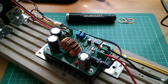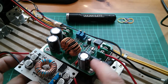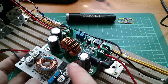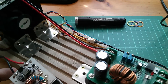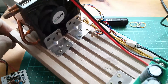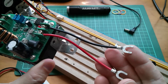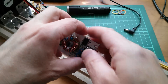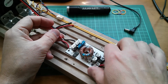So let's give this a try on my LED project board. It's going to replace the 600 watt boost converter which I normally use — a two-pot version, very similar in function. It doesn't look like it's got quite the same amount of capacitors, and I'm going to try and drive a single 100 watt LED, which is on the front of that heat sink. So let's take the 600 watt boost converter out. I'll reuse these wires to connect to the terminal posts on the input of the new boost converter, positive and negative the right way around.